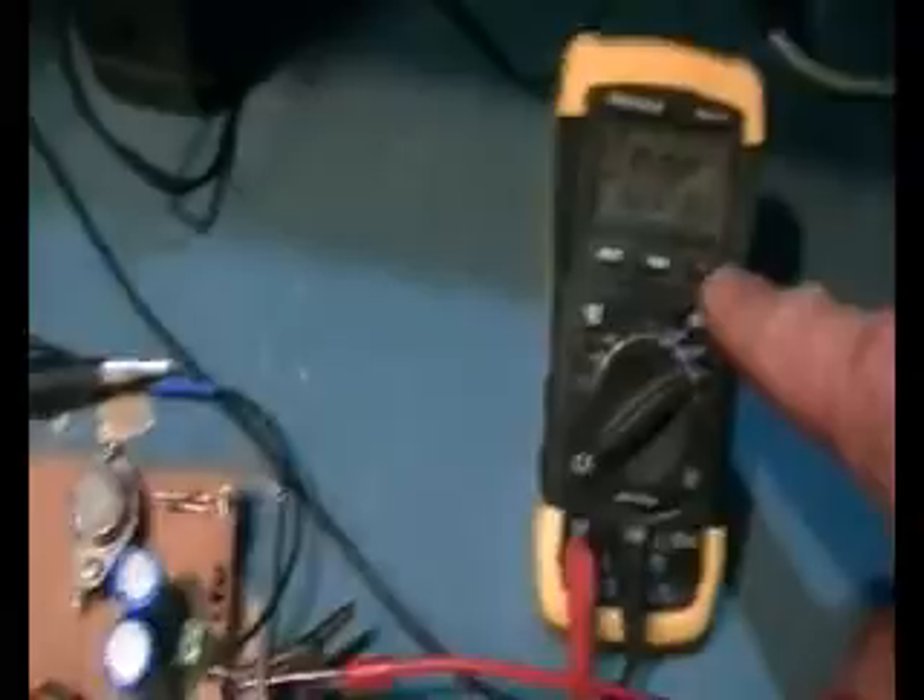26.7 volts in our two run batteries and 12.8 volts in our charge battery. This meter here is just hooked up on this cap via the two lines that are going to our light. I'm using an amp meter here just to come off the positive side to go to the positive side of our load. So once we're up and running I'll just hook that on there and we can watch what happens.